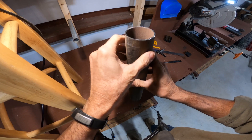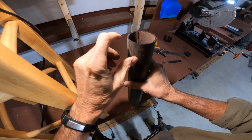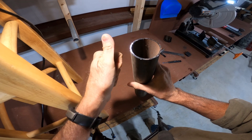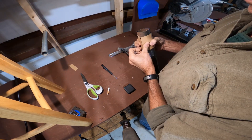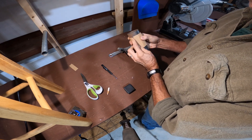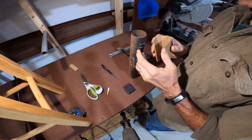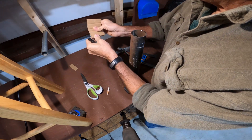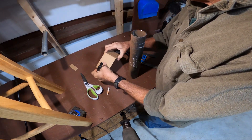That way, if I have two vertical pipes at each end and I align my saddles to that seam, the saddles will line up properly. One of the key things about making these saddles is to cut the angle 180 degrees out — you cut on one side, then rotate the pipe 180 degrees and cut on the other side.